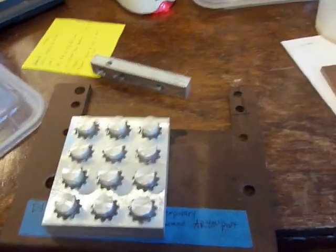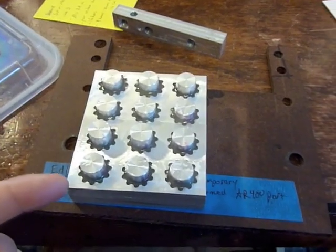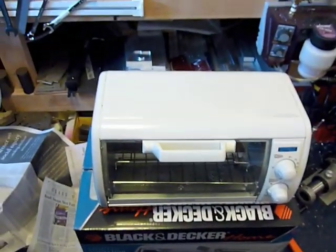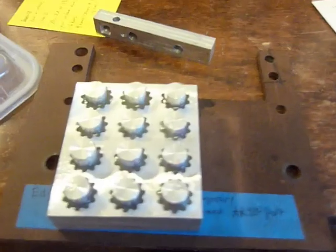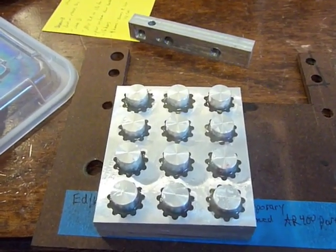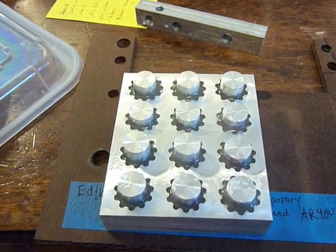What I'm going to do is take one out after 16 hours, videotape it, and see if I can get that out. But then the rest I'm going to throw in this little toaster oven here. The Smooth-On website says that you can improve the performance and strength of the rubber without hardening it by throwing them in a toaster oven for about four hours at 150 degrees.